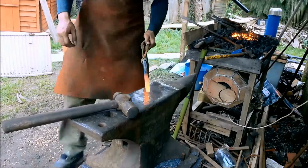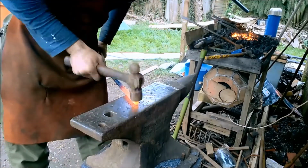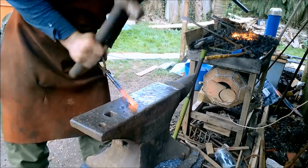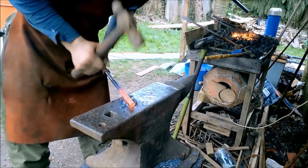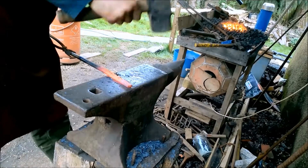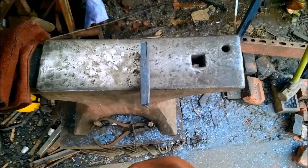I now start forging out a bar of silver steel that will be the core of the knife. However, because the bar was fairly narrow, I couldn't make it wide enough to insert directly between two pattern welded outsides, so instead I welded it to one side of the billet and folded it over, making the silver steel filling thicker.